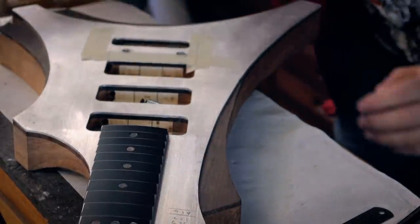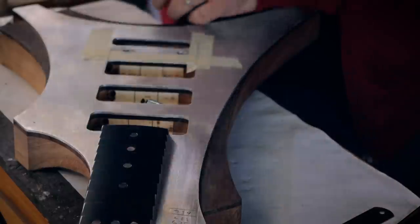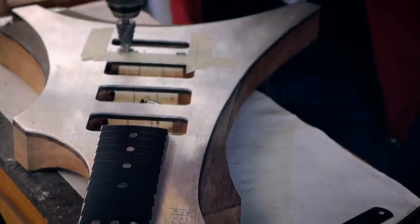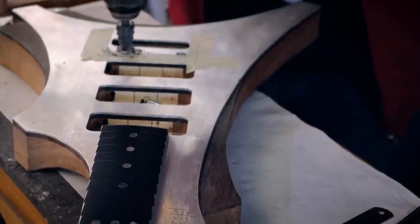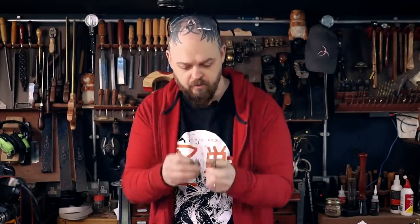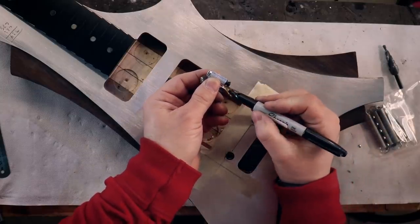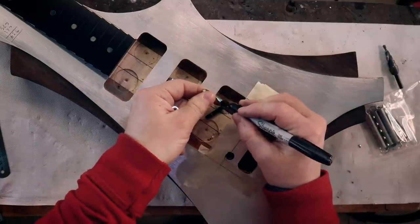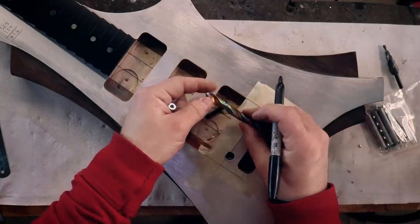Okay, so I have gone just through the aluminium with the 10 mil section of the step drill. Okay, and it's going to be a little warm. Before this goes in the drill bit, I need to know how deep to drill and mark directly on the drill bit where I want to go. And then I take it just a little bit deeper.